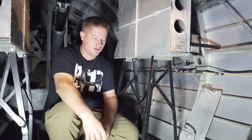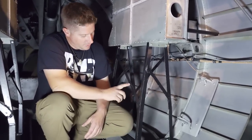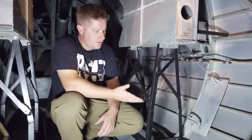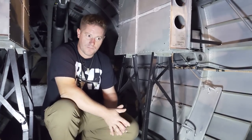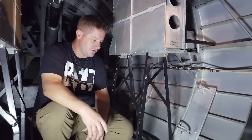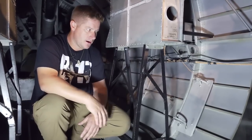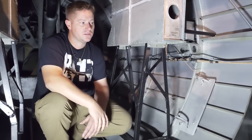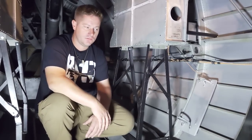The longer a belt has to travel, the harder the feed pawls work to pull it into the gun - sitting the feed system on the ground fighting to pull the belt up two or three feet would work but put strain on the belt and increase the chance of stoppage. By raising the feed system and moving it as close to the gun as possible without hindering traverse, they achieved a near-direct feed into the gun. This was done without authorization or approval. The debate about whether these were actually installed in the Memphis Belle was settled when a staff member during restoration spotted them clearly in William Wyler's film footage - confirming this was done in theater specifically for the gun system, not a post-war fix.